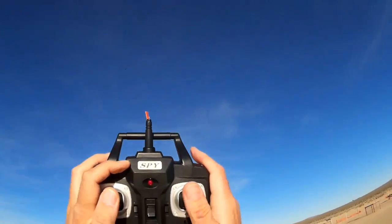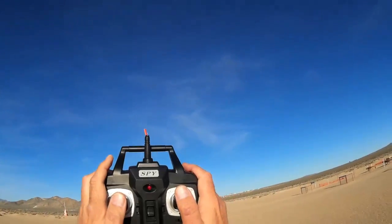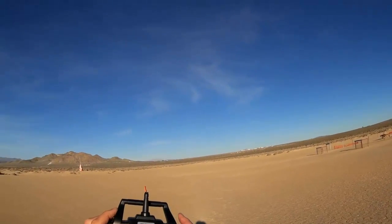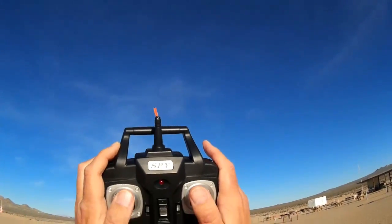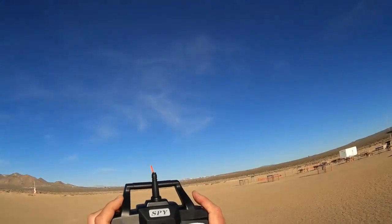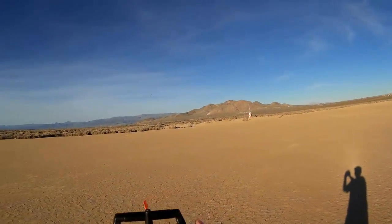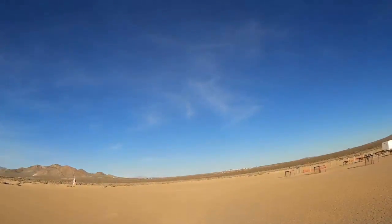I'm going to back up — let's take it a little further, see if we can go to 120. See how I'm orienting the transmitter. Okay, I'm at about 120 right now. So it's about 120 meters before I lost reception again. Backing up a little further — very high right now. Still pointing it... okay, lost reception again. The range seems to be about 120 meters with this modified antenna — that pylon over there is about how far that is.